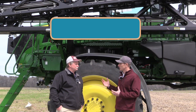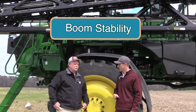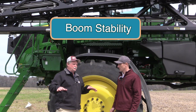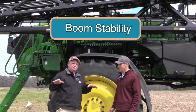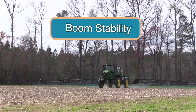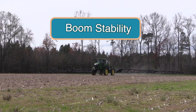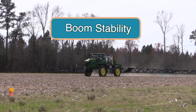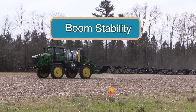One of the new features on the Ultimate platform is the boom stability. John Deere realized they had to increase the boom stability to keep the cameras at the right height while spraying. So they added a roll sensor in the back, completely redesigned the boom attaching mechanism to the sprayer, and added two more BoomTrak Pro sensors to the boom for even more survey of the terrain to help with the boom side-to-side and up-and-down feature.